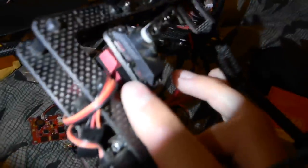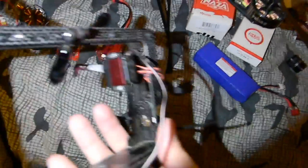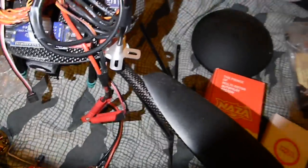Here's my camera mount — it has shutter and gimbal support. My servo currently burned out; the original was one of those red ones. Get rid of those because they're plastic and metal gear mixed and they can't take the load of the camera I'm using. I just need to get a better metal gear, high-torque servo that can support the weight.